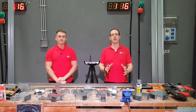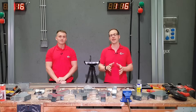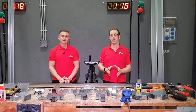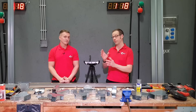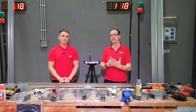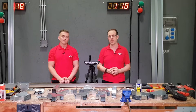In this video, as part of our ongoing series on the subject of metal trunking, we're going to look at some of the accessories that you may come across when you're working with this product. Most of the accessories relate to 50mm by 50mm trunking, although we are going to look at some accessories that relate to the slightly larger 100mm by 50mm trunking, including a couple that will take it from being something you just use to carry cables into something a little bit more practical for your electrical installations.